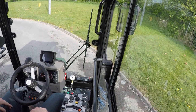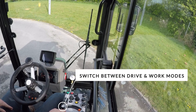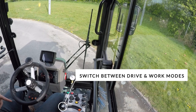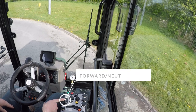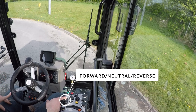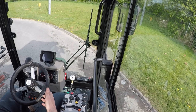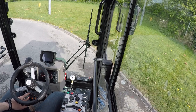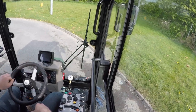To drive the machine, I select my drive speed and my drive mode. There's a two-position switch — the road symbol for drive mode and the hammer symbol for work mode. I have it in drive mode at the moment. I've got my forward, neutral, and reverse switch, and then my accelerator and brake pedal on the floor, so it's really like driving a car. I make sure my handbrake is off — that's the button on the steering column — and then I simply press the accelerator to start driving.